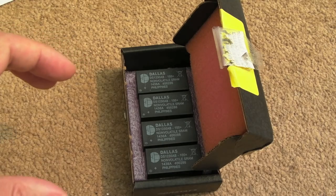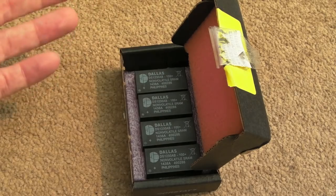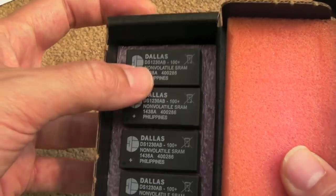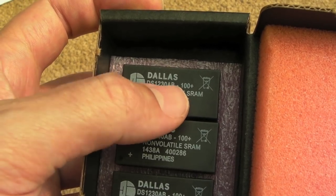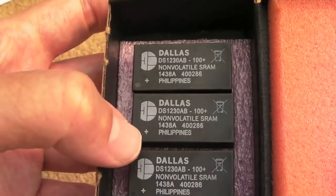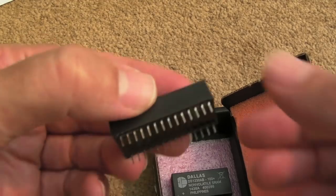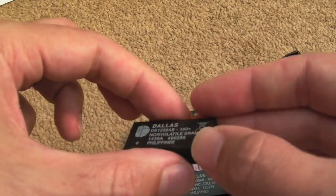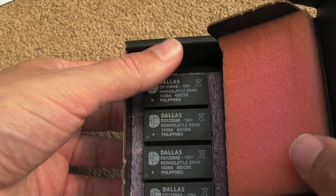Ultimately I'll probably go for something a bit more elegant for sideways RAM and ROM. You can get a board that sits in the CPU socket with a battery for holding settings, some flash so you can flash your ROMs, multiple ROMs up to 16 slots, and 128K of RAM. But in the meantime I thought why not have a go with these Dallas chips. These are non-volatile SRAM — same DIP footprint but a bit of a larger package. It's perhaps got a lithium battery in there like the Dallas real-time clocks. I've got two more of those and some larger 128K ones as well.